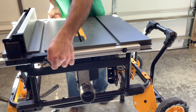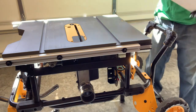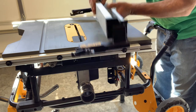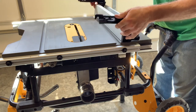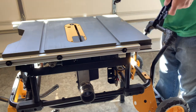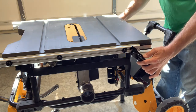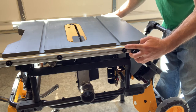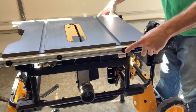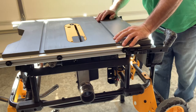When you remove the fence, turn it upside down and go underneath the saw — scoop it down, then raise it up. Make sure the tabs on each side of the metal rail hook over the pins, pull it up, and lock it into place. Leave it just like that and it's ready for storage.